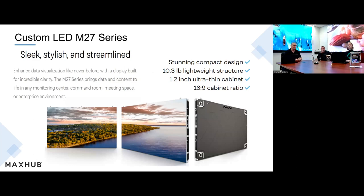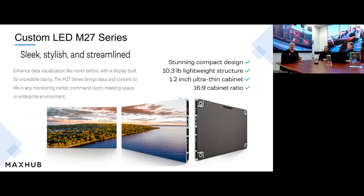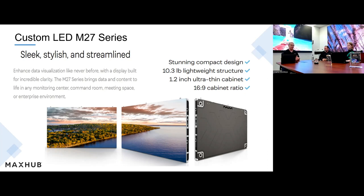So our M27 series, it's our model number for it, only weighs a little over 10 pounds per panel. They're aluminum chassis, and again, 1.2 inches thick. These cabinets happen to be 16x9. Depending on the size of the event, we plan the number of panels. But because each one of these is an individual panel that we have to connect to, this is why we would use a Novastar controller that has multiple I/O built into it to be able to address each one of these panels. So we can play content on a single panel, or we can play the content on all the panels that are bolted together and give them any kind of image.